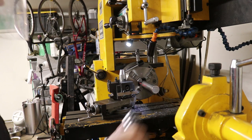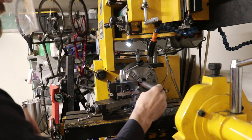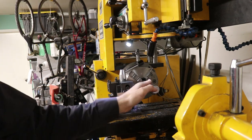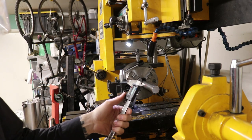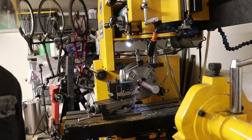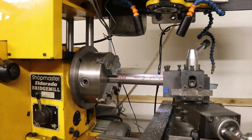This live center will allow us to keep this thing steady, and then we'll go ahead and do our lathing on it. We'll bring this thing down to the size we want and keep checking it with our calipers to make sure we're where we want to be. Let's take a gander at how this thing spins.